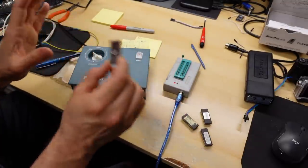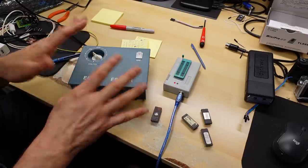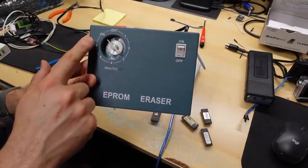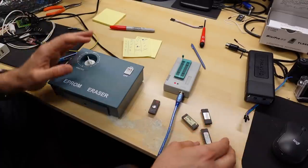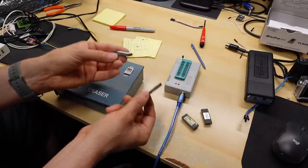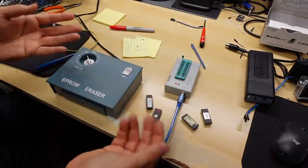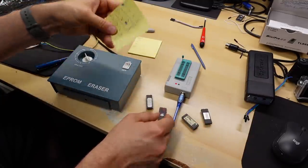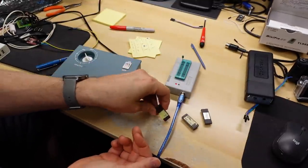Meanwhile, this one here without the covering gave up the ghost after just 30 minutes — and it probably would have erased in even less time. Usually around 15 minutes is what I leave chips in for. Although this broken timer only goes up to six minutes, so maybe six minutes is all you need to erase an EPROM. Anyhow, I still stand by my assumption that an uncovered EPROM inside a computer is really safe — there are no ultraviolet rays bouncing around in my basement or in most people's houses, because that would be damaging to humans, not just EPROM data. But if you have an EPROM and you're concerned, just take a little piece of paper from a post-it note, stick it on, and that is good enough.